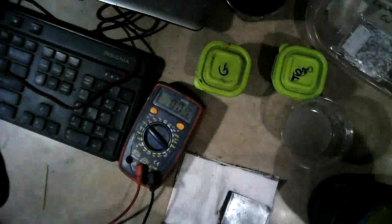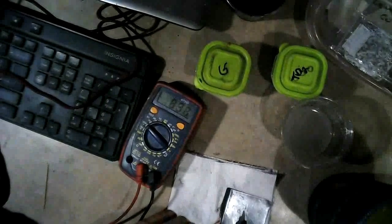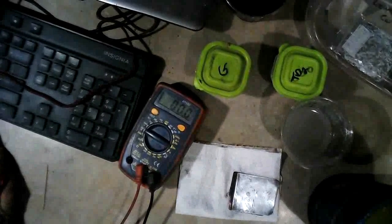I'm back, and I just discovered that I've got a short in this cell — I think it's right here in this corner. I'm holding down this corner so I can measure. That's probably why we only got 14 milliamps last time. This time we're going to do it at 0.862 volts, and hopefully we'll get some better amps out of it if I don't short it out again. Here we go: 3, 2, 1 — nope, 13 again. Well, hell. It was a better cell than that. Looks like I'm going to have to redo that one.